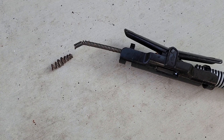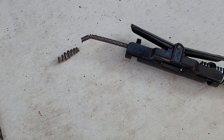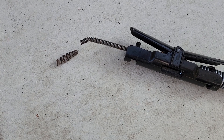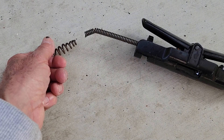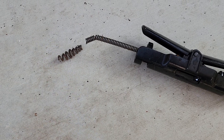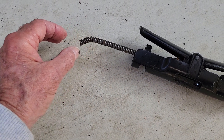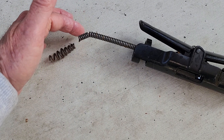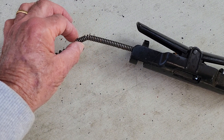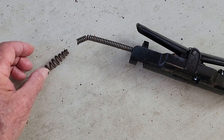The first one is a trick that a plumber taught me years ago. Here's the trick: cut off that end, which is kind of just a little bit thicker than the rest of it, meant to capture things. Then bend the end over at a 45 degree angle. That gives you a nice arc swinging, but it stays thin enough where you can fit it into places where you couldn't fit the big fat original end.